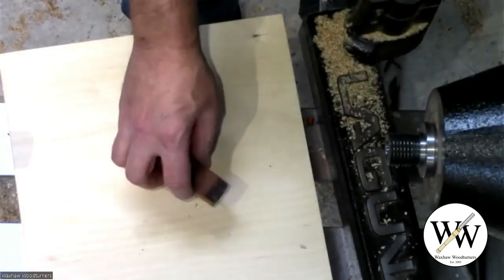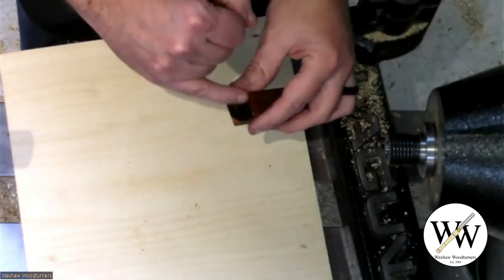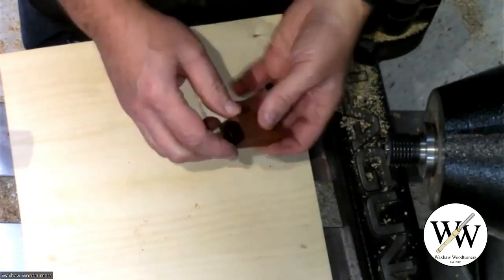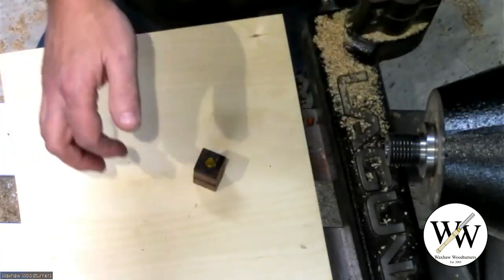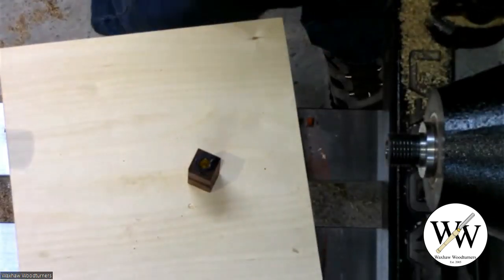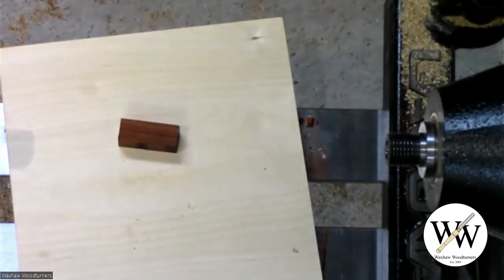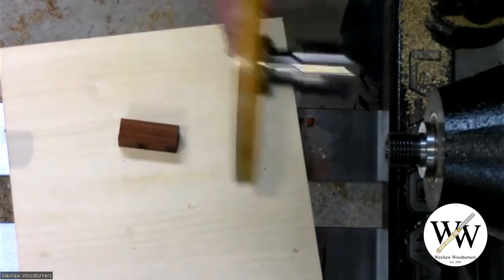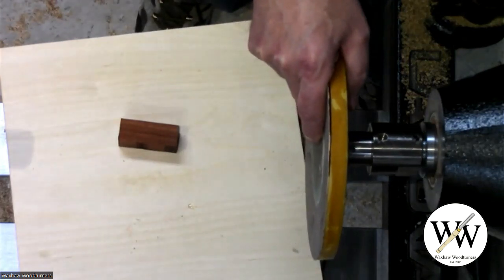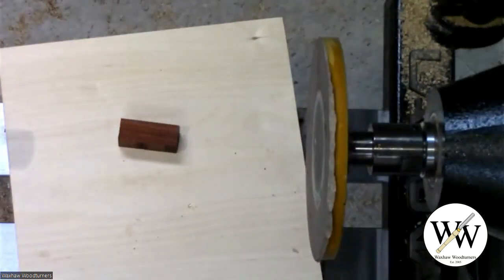Next thing you need to do is to trim the barrel. What that means is you need to clear off the excess wood where it's square and 90 degrees to the tube. There are a couple of different ways to do this. I've seen people use a hand drill. Actually, I've been guilty of that myself. But what I like to do if I'm at home is use my disc sander, and actually John brought a little sanding disc. I'm not going to do it this way, but I'm going to at least show you what it is. So pretend this is my disc sander at home.